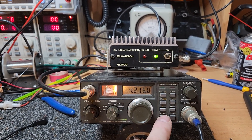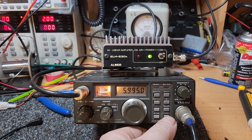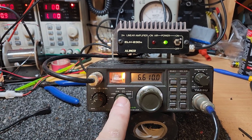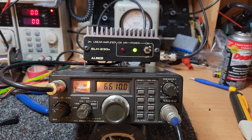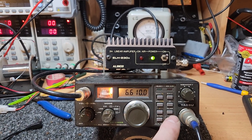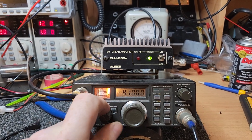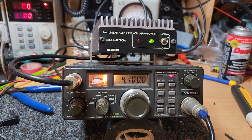These were a good little radio. A lot of little functions on them - you just sort of run around the place. Step functions, VFO, et cetera. Set the squelch. You could easily just chuck your repeaters in with plus and minus split. Not a lot of memories, but 10 memories will get most people out of trouble. But for those that wanted to do sideband - brilliant. Because you could just put yourself on 144.1, throw yourself into sideband mode, and you had a radio that was ready to go. And transmit away.